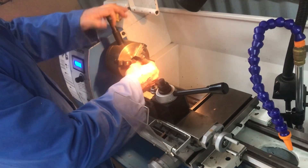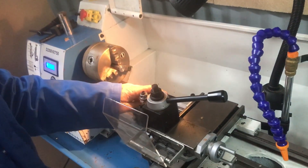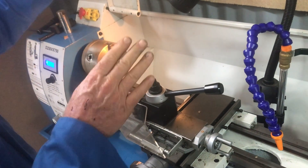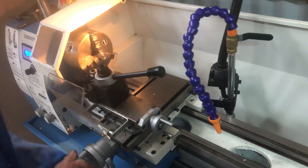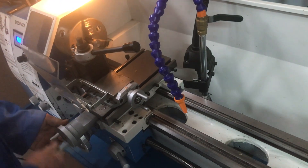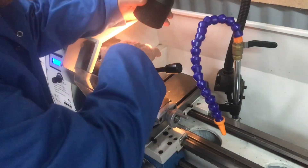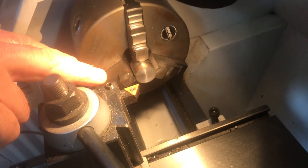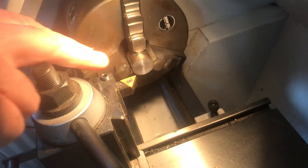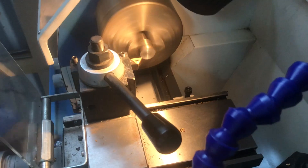The main thing when using tungsten carbide or high-speed steel cutting tools is that you must have your lathe tips right on your center height — not a little bit up, not a little bit down, smack on. The simplest way to check is to take a cut to the center of a spigot. If it's down or up, adjust until it's spot on. Don't worry about the tailstock — it all comes from your headstock.